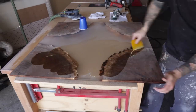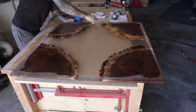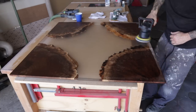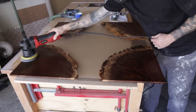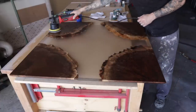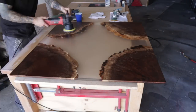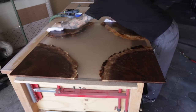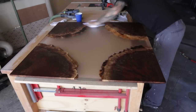After all that madness I finally get to jump on the Rubio Monocoat — the pure clear version is my favorite. They have other tinted stains and finish coats, but since this was a clear frosted epoxy table I wanted to stick with the clear. I used a cheap orbital polisher and found five-inch Scotch-Brite pads on Amazon that were perfect instead of cutting my own strips off the rectangular blocks. They save a little time and if you store them correctly you can actually reuse them if you're doing a few tables in a row.